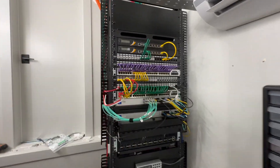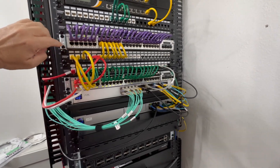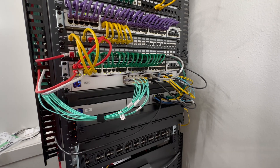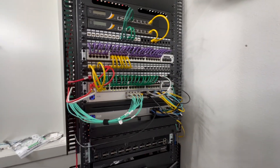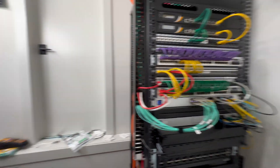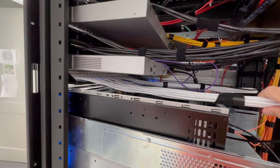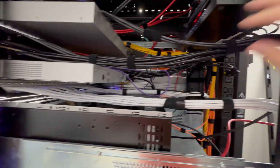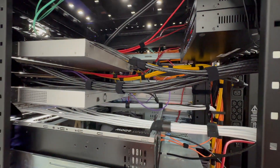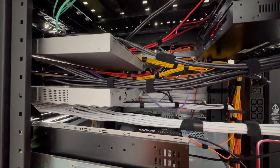Looking at the network rack — all network stuff here. These connections are all drops from other parts of the house; it's a more typical layout. The drops come in the back and connect into these PoE Cisco switches. The aggregation switch is primarily fiber connections to other switches in the house and the server rack. With the side cover off one of the racks, you can see these are the RJ45 keystone patch panels. I've bundled all the cables together based on color, which is based on network, running back down the cable managers into each of the boxes. Very neat and tidy — and maintenanceable, since I can pinch and disconnect a single cable, unroute it from the bundle, and replace it if needed.